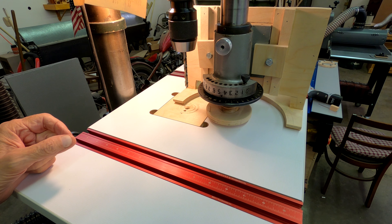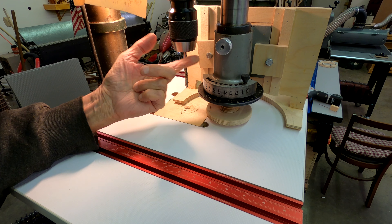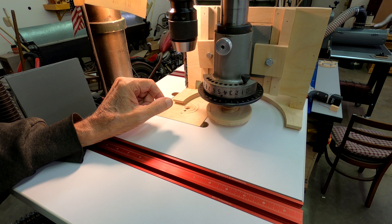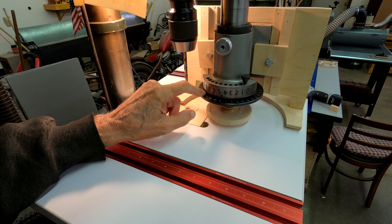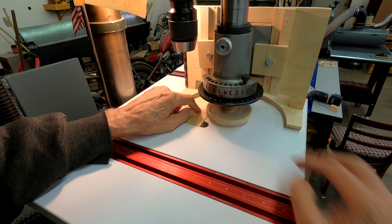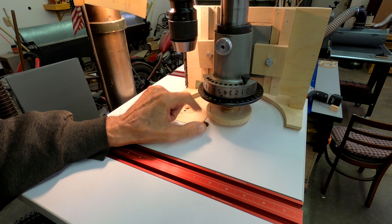This is just to show you what I use to make the indexing ring on my drilling fixture. This thing here is what they call a spindex — it's used most of the time for milling and lathe work, but it also works nicely for this purpose. It's marked around the edge of this black ring in 5-degree markings. To use it you set it on zero, glue your plywood disc to the bottom using hot glue. It's a little spindle that goes in a 5C collet.